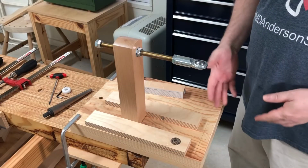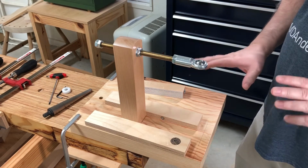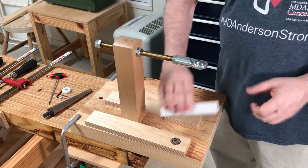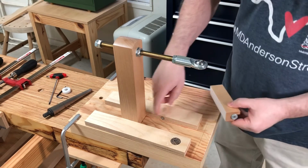I'm going to set this up like I'm drilling from the bottom side of the seat, and I'm going to drill a 16 degree leg mortise. So the boring jig comes with this handy setup block. Setup block has a magnet here that interfaces here.